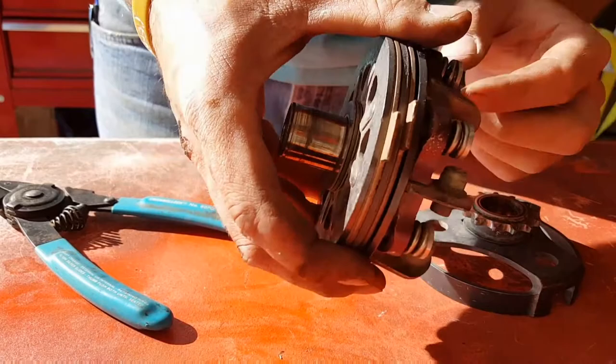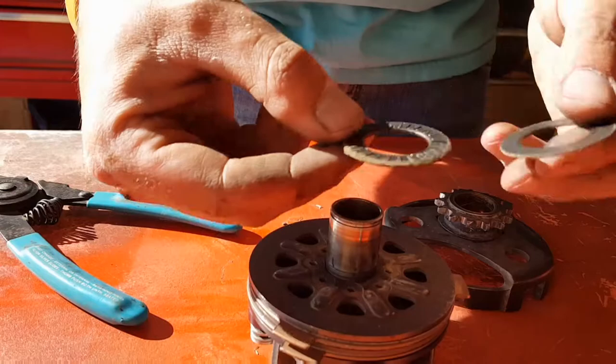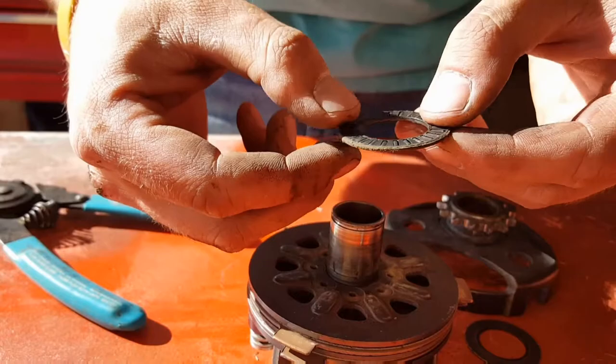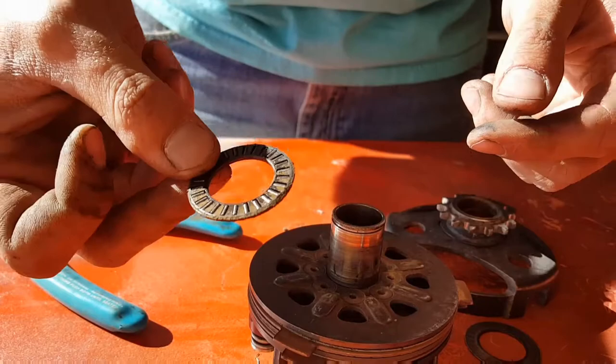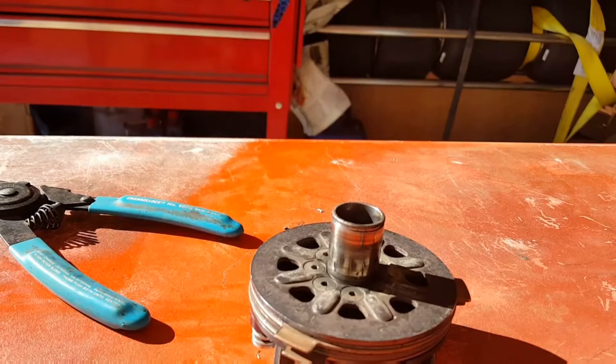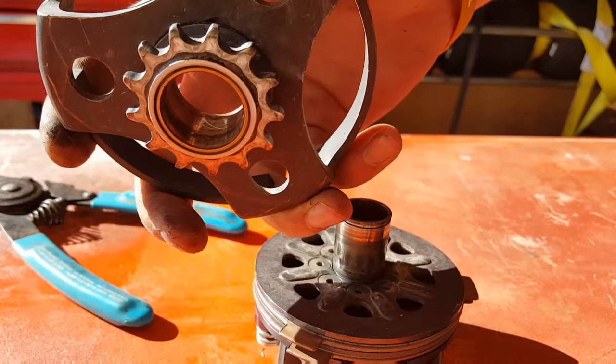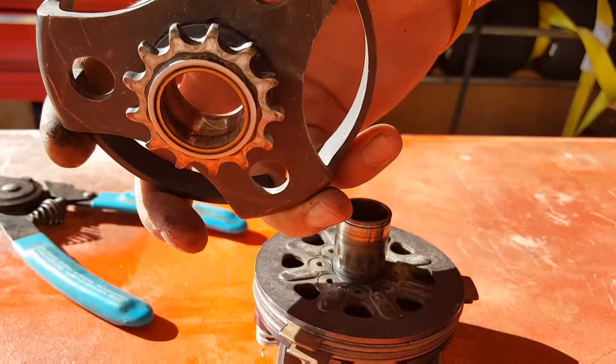This will make it even better to show you guys. What you're seeing here — the carrier — this here is a thrust bearing. It's supposed to be wet all the time, and as you can see, it's been lubed, but not recently — probably not within the last couple of years. You can see how that bushing is all scoured up and burnt almost. That is what happens when you run a clutch and just keep running it without maintenance.